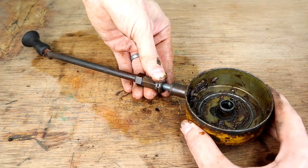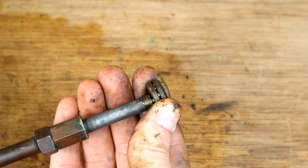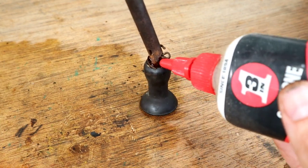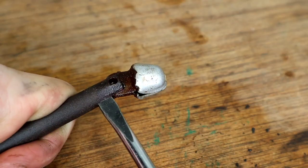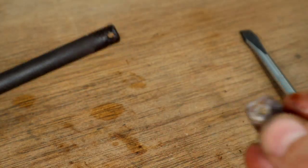With the spring out, slide the shaft in the main housing. This will allow you to take the nine ball bearings out — and of course they rolled right off the bench as soon as I put them down. I tried pulling the rubber vacuum cup from the plate but was unsuccessful. Instead, I had to add a little oil and pry it off. The plate is held on with a cotter pin and was easy to get out, but the plate had rusted and slightly expanded into the extension piece, so it took some work to pry it out.